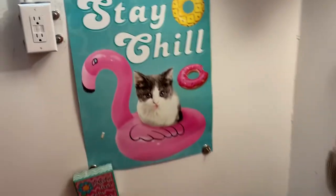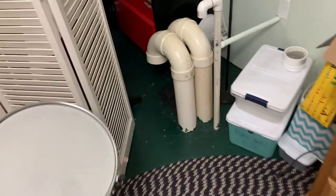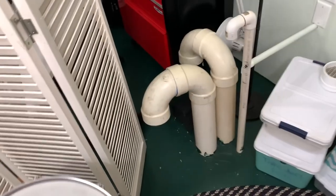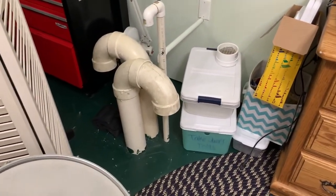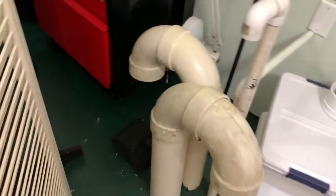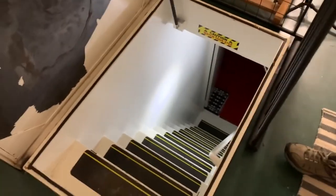This is the air out valve — air comes in supposedly over here and comes out over there. In a shelter for proper airflow you should have one on each side, caddy-corner or straight across so the airflow travels over the entire bunker, letting CO2 out and fresh air in. They could at least turn this 90 degrees the other way. See what I did? Now the CO2 is coming out over here and will dissipate by the time air is being brought in. To have them the way they were — on every bunker — that's just stupid.